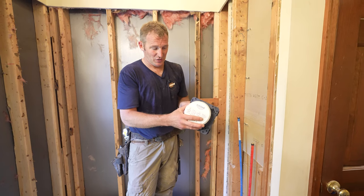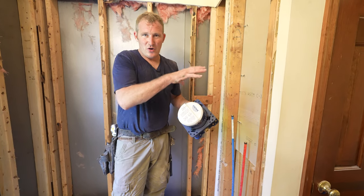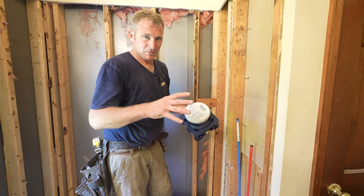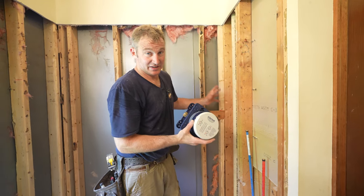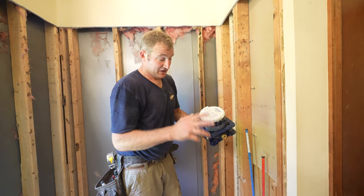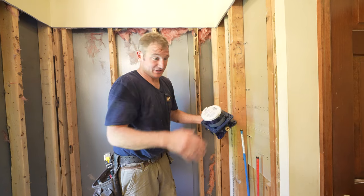This is the Grohe box. Basically, the hot and cold come in through the bottom here. And this thing can do all types of different configurations when it comes to your shower system. In this particular bathroom, all they're doing is a shower head and a handheld. So it's really kind of simple in that aspect, but you can add three different features. You can connect another one together so that you have multiple valves for body sprays and all types of things.